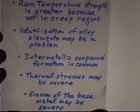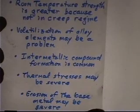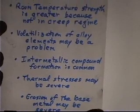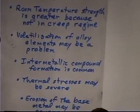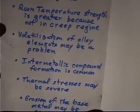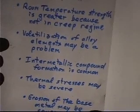It is true metal-metal bonding, so you're getting the primary bonding. That's if we're talking metals as base materials. If you're talking ceramics, ceramics will fracture because they're brittle, and you're not going to get 5 ksi.